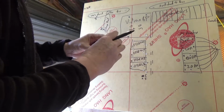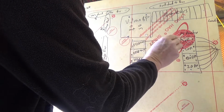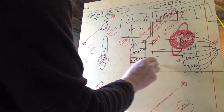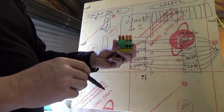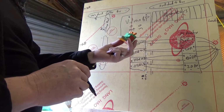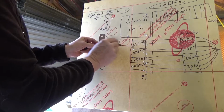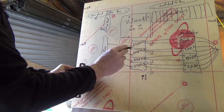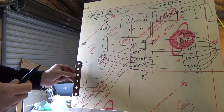Now from there they will be connected to my DSSR 20s, which means that I need positive and negative, positive and negative, positive and negative, and positive and negative. And these will actually be doing the work. So the Electrodacus SBMS0 controls these, turns them on and off in order to manage the charging of my battery. From there, the positive simply goes to the positive bus bar, and the negative will go to the negative bus bar. And that's my charge circuit complete.